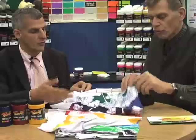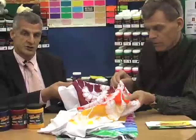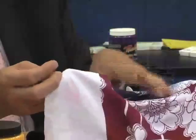Screen printing for textiles needs to be comfortable, but typically a soft product would wash off. We have exclusive access to a proprietary polymer that gives both softness and strength. This has been tested to 30 washes at 150 degrees Fahrenheit under commercial conditions with negligible sign of degradation of the print. In fact the wash environment was so aggressive that the unprinted areas were actually degrading, while the printed areas were actually helping to hold the textile together.